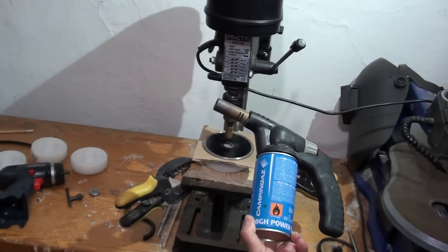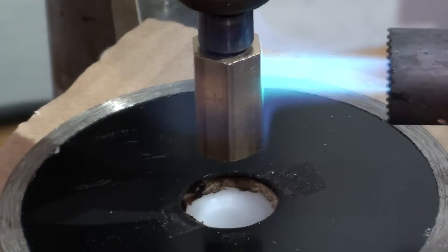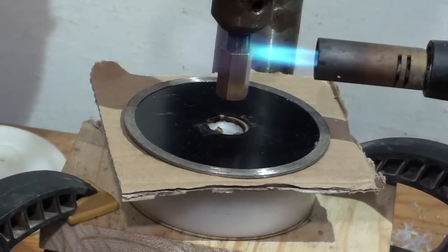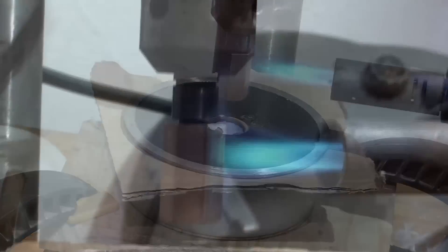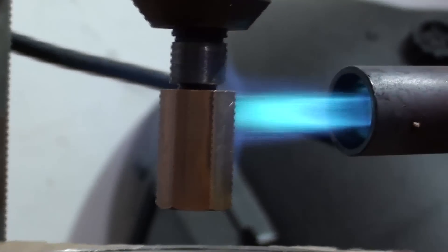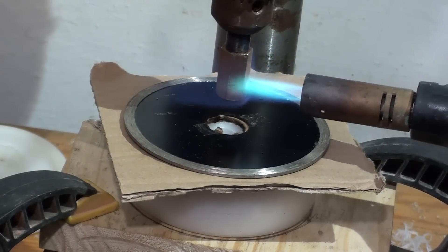Using fairly low power, not a very big flame, and about a minute has worked for us. If you're wondering why we're putting cardboard near the flame: if we only had the metal disc protecting it, the disc would get hot and melt the nylon beneath — so there is method in our madness, even though it's a bit rock and roll. Notice I'm just using the point of the bright blue flame, which is the hottest bit, not pointing it down so it puts a flame on the cardboard, and we don't want to overheat the chuck of the drill either. It doesn't matter if you play just on one side of the brass, because the heat will travel around it pretty fast.